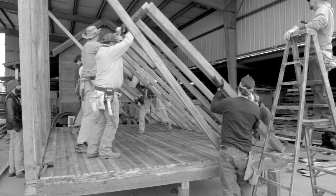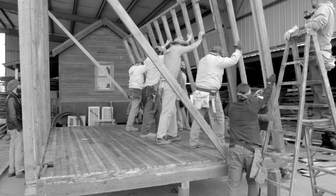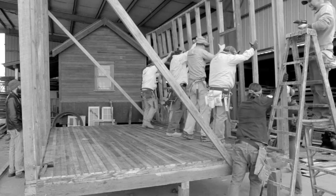Because of these prefab modules, things like our back wall, we literally carry those things out there. We pre-cut the extra studs, the fill-in studs, and had the corners and the bottom plate and the top plate. The whole thing came together within like 10 or 15 minutes, which is pretty incredible. It's a really good way of leveraging people that don't have a whole lot of skills — we can take those people's efforts, put them in a prefab unit, stick it in a wall module, and our wall module is done at an incredibly fast, incredibly quick rate.